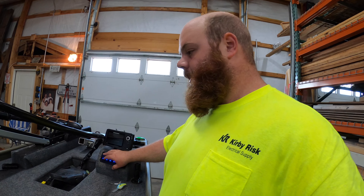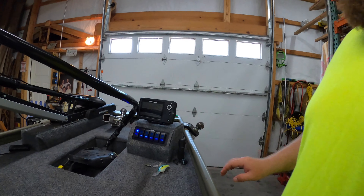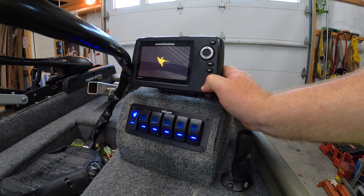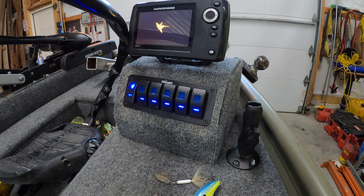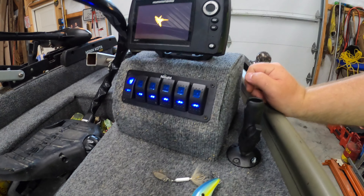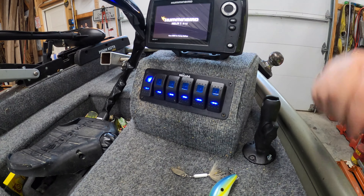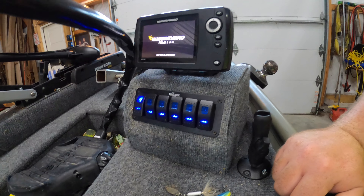You don't have to go to this extreme, but I'll show you some nighttime clips as well of it running. For right now, I'm going to give you a quick rundown of what it is. This first switch runs the depth finder and fish finder. All the wiring — the hub for all the wiring — is inside of this box here. It's kind of a jumbled mess in there, but basically I'm just making a loop from this switch, looping it to the depth finder. It was a small run and pretty easy to do.